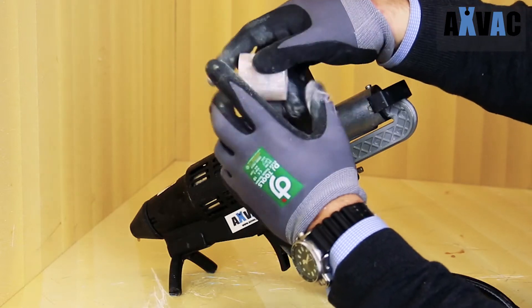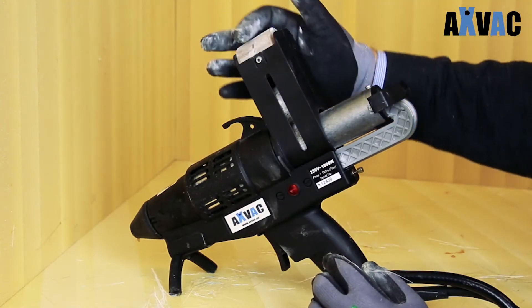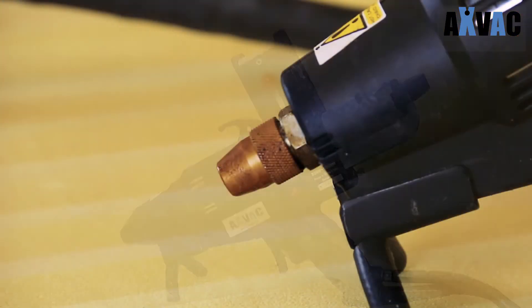Try to avoid the occurrence of fibreglass fibres when the glue slugs are inserted in the speed loader. The fibres will not melt, so the fibres will interfere or, after some time, block the nozzle.